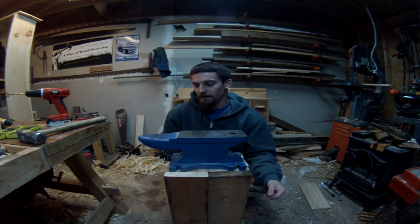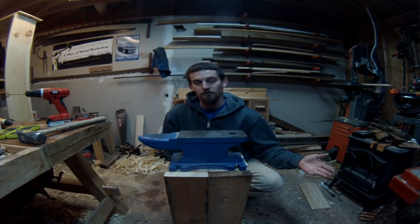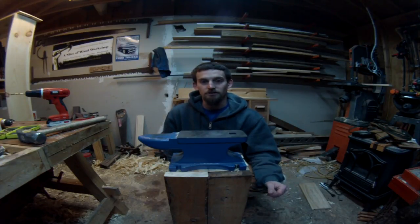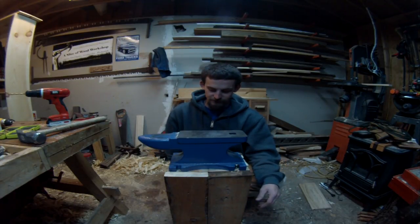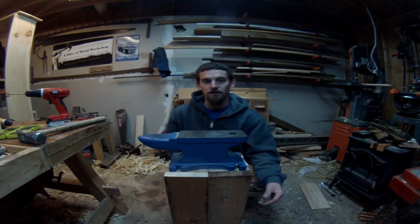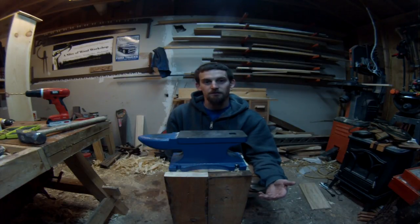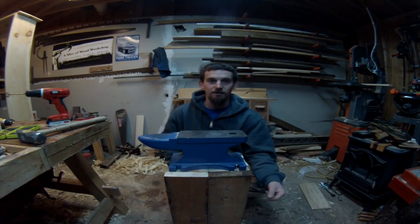This one's going to be staying inside the shop, but it is light enough that if I do need to move it outside, I can go ahead and just pick it right up and take it outside next to the forge. Hopefully soon I'll be building a gas forge that I can actually keep in here in the shop and just mainly do everything in here, not have to worry about the forge outside too much unless I get bigger products. So thanks for joining me today. I had an awesome time building this and it was really simple to make — just cutting up some two by sixes, checking my height to see what I needed to do, and then subtracting the height off of the anvil and constructing it up with some pocket hole screws, then screwing everything in a laminate design together.